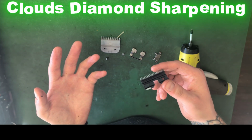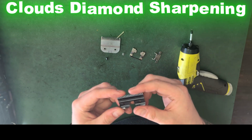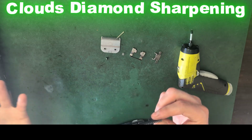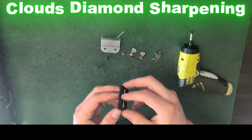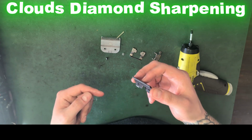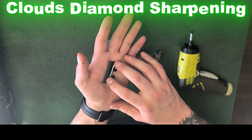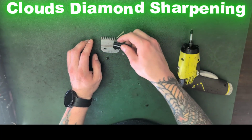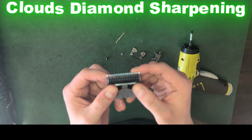And that's a guarantee because we put shape in it and it's proven that our sharpening lasts the longest. I'm not saying other people don't have shape on their wheels and their blades won't last. I'm saying that's what we try to do our best at. I have to resurface my wheels so they give these blades shape, because if I was sharpening on a block, which would be much cheaper and easier, we could do that, but you guys would be coming back every week or so, and that's no way to run your business. So what we perfect is the shape and how long they last. Plus, we want the lightest tension, so it causes the least amount of heat but still cuts. So we sharpen both sides of the blade, so any blade that can be disassembled we can sharpen, and we will sharpen.